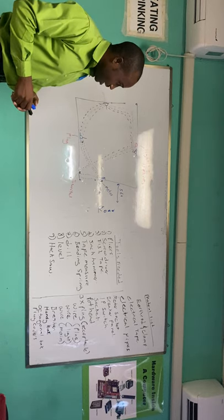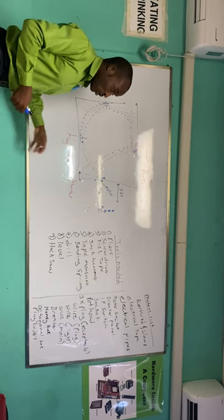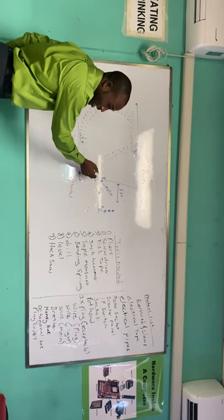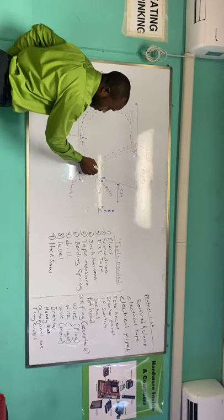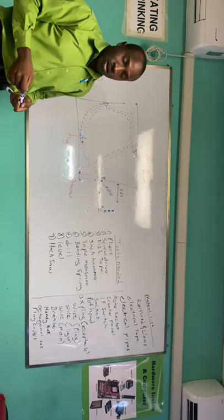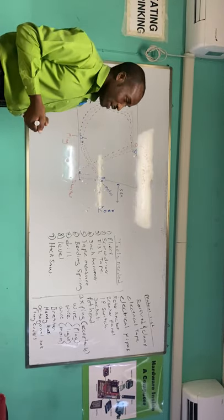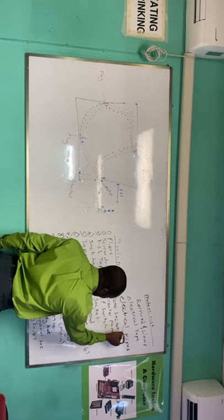These electrical pipes — as we said earlier, the installation itself will be done flush, so nothing will be surface-mounted as shown here, but everything will be in the wall. For it to be in the wall, the cables must go into conduits. For this particular design, going to three wires — a live, a neutral, and an earth — for this setup, we would use the smallest size electrical pipe, which is 20 mm conduit.